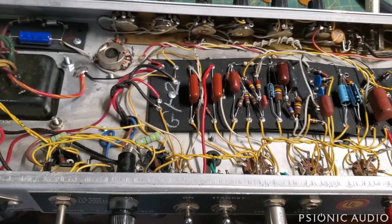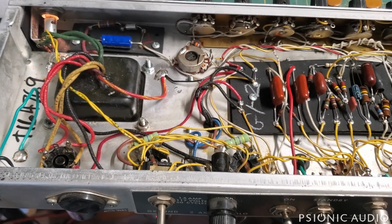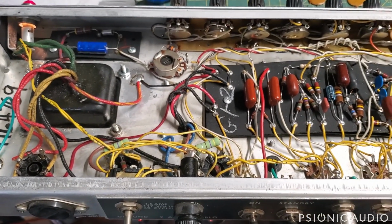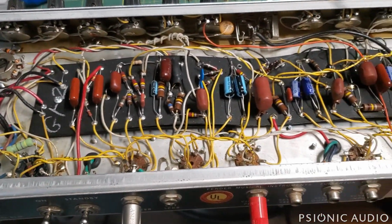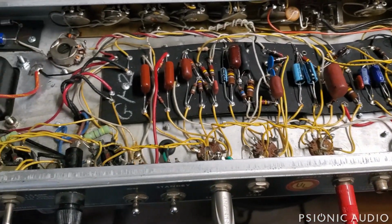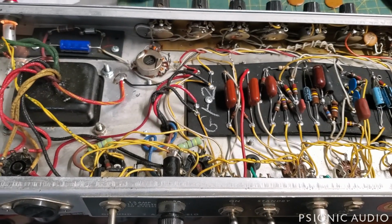After the amp had been on about 5 hours last night, it started to do it a very slight amount, but it was late at night and I had to stop. So I turned it off and I've switched it on, and I'm waiting for the tea kettle to come back, at which point I will pull tubes and see if I can isolate where it is, if it's in a particular channel or if it's in the output or whatever. These mystery problems are always fun.